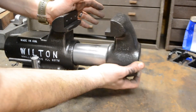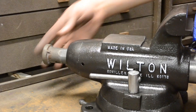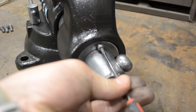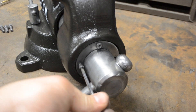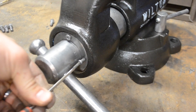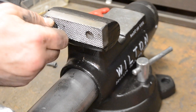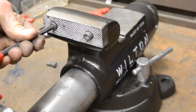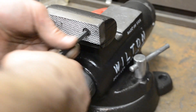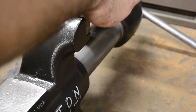Next, we're going to put the main barrel of the removable jaw back in place. Slide in our nut and put the pins back in, which happened off-camera — it's kind of a pain in the butt, to be honest. Slide that removable nut back in place, the lead screw's back in. We reinstalled the U-shaped piece that holds the lead screw to the removable jaw with those three screws, which I managed to not lose. I used the sandblaster to knock all of the grease and garbage out of the Phillips head. The sandblaster was absolutely essential to clean the cross-hatching on these jaw inserts — they were so caked full of grease, dirt, chips, and debris from 40 years of use that it would have taken forever with a wire brush or wire wheeling.